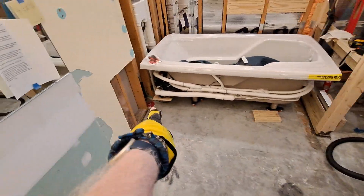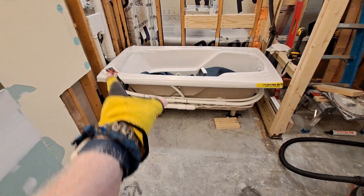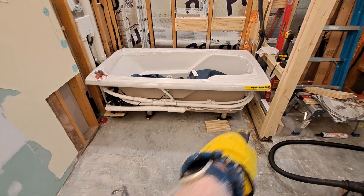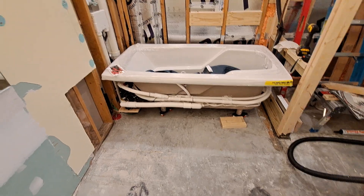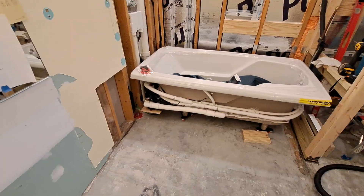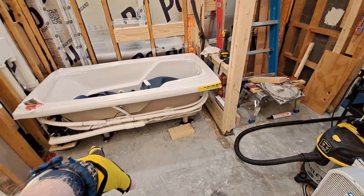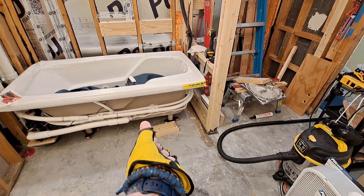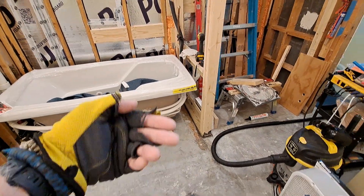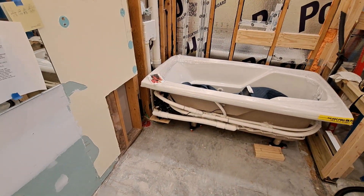I want to take a measure from here to here, get my 2x6 cut, and then figure out the measure from that 2x6 back to the bottom plate to make my 3 cuts. Because it's going to sit on top of the 2x6. That's going to be just for heightening — instead of having the legs go on the concrete, I figure an inch and a half is not going to matter, and it will allow me to put some insulation in there and make it all nice.